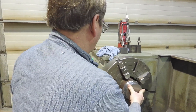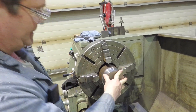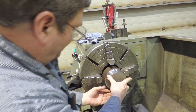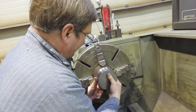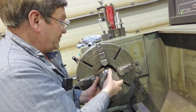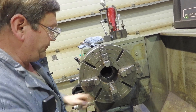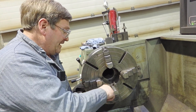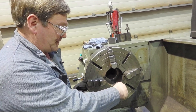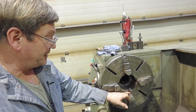Now on your four-jaw, besides the chuck itself, you've got rings back here. In this case, those rings aren't going to do us a whole lot of good initially for lining up because this piece is pretty close to center. You can kind of eyeball the rings, but it doesn't give you a lot of help. On a lot of four-jaws the jaw itself—if you have ones that have really sharp serrations, and hopefully it doesn't have a serration right in the middle of the jaw—hopefully the very middle of the jaw is flattish.